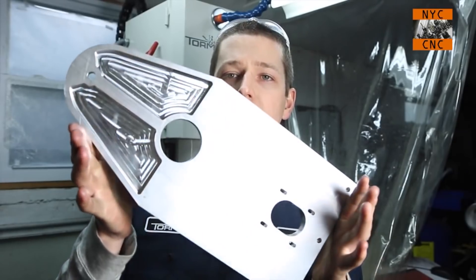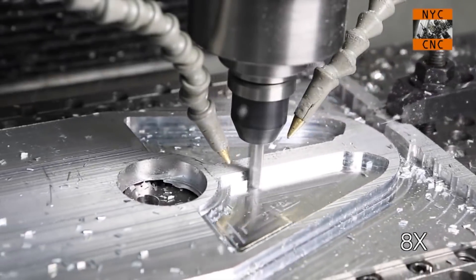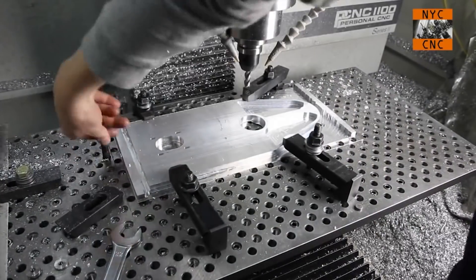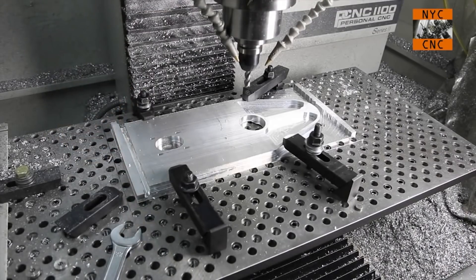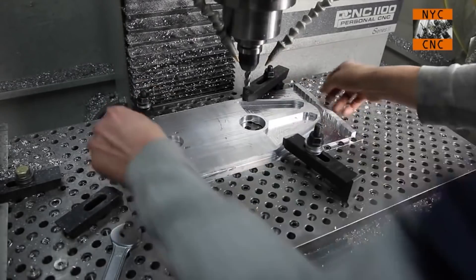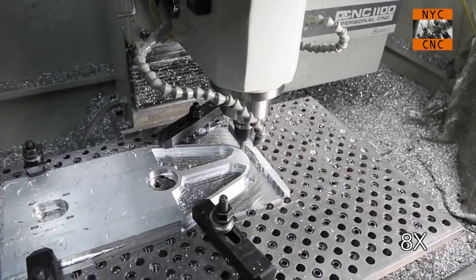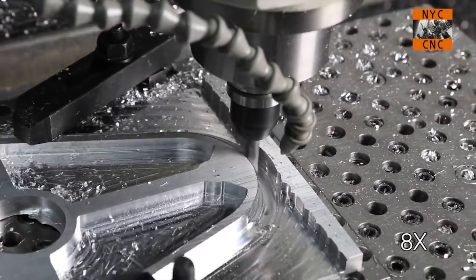Finally, in one of our oldest videos from 2014, we're machining a large aluminum plate. Sometimes the best thing to do is just directly clamp it down to your machine table or fixture plate — strap clamps work great for that, but don't hesitate to get creative. Add and move clamps as needed to maintain adequate clamping as you work the part, and don't hesitate to complement those clamps with super glue or even vacuum. One of the best things you can do to increase process reliability of vacuum on tricky parts is add even a single strap clamp or mechanical fastener — we found that massively increases reliability.